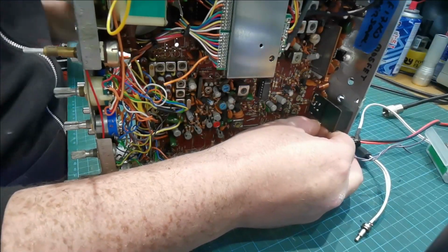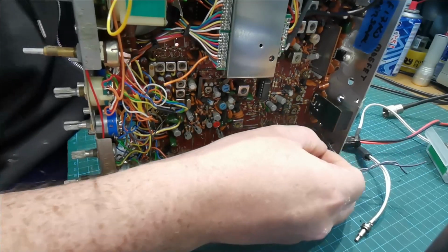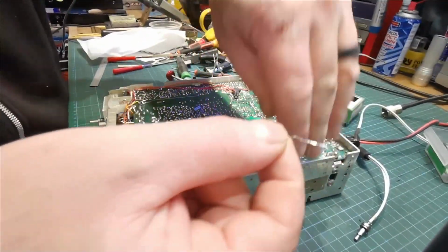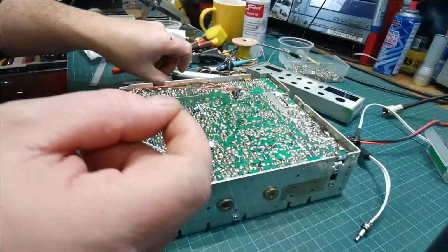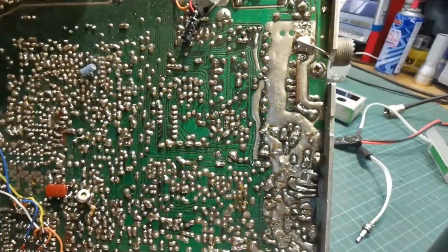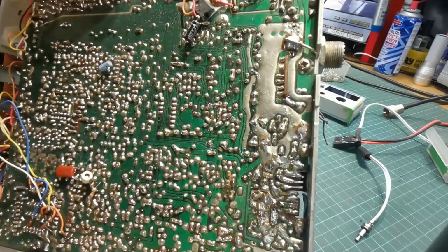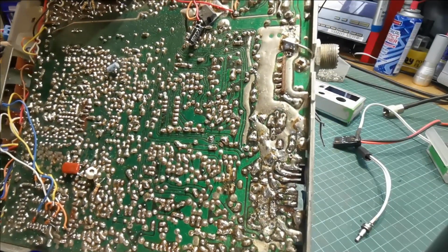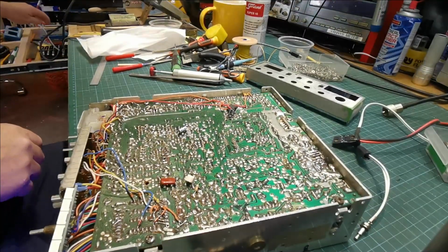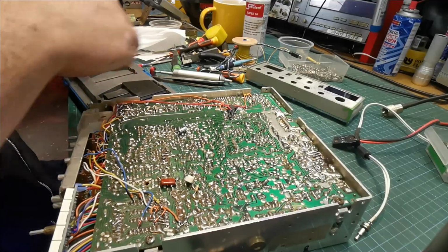Bear with me now for a second, folks. Now, that's out, down. Like, that's just the tail off a resistor. It goes into that little hole there. You can see it here. So what we're going to do is we'll drill out that hole a little with a hand drill. You don't want to be going at this with your Black & Decker.